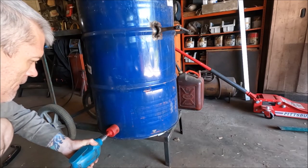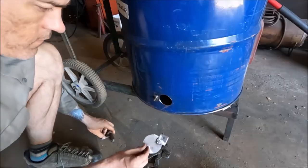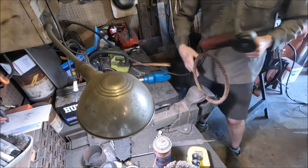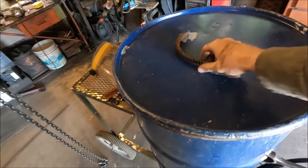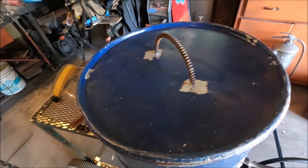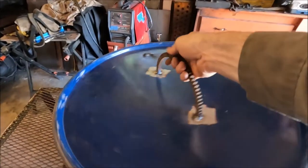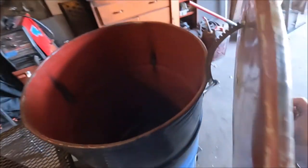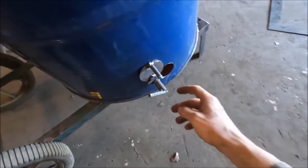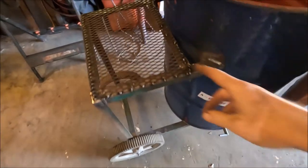I want a vent on the bottom of the smoker to allow air to flow into the coal box. I'm using a three inch hole saw and then making a little adjustable cover to go over the hole to regulate airflow into the barrel. I've also got a scrap piece of gearing off a snowmobile that I'm using to make a handle for the top of the smoker, plus a little hook on the side so I can hang the lid out of the way while cooking. So far we've got a handle, a top handle, a basket inside, an adjustable vent on the bottom, and a little side table.